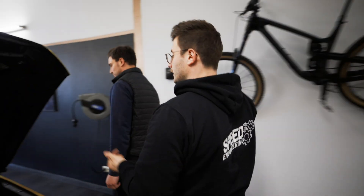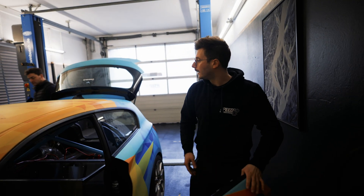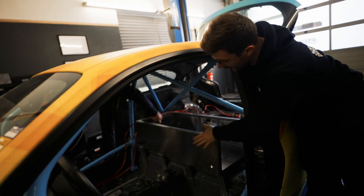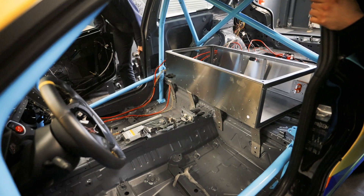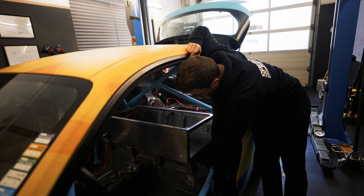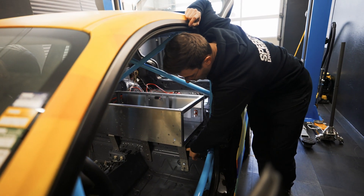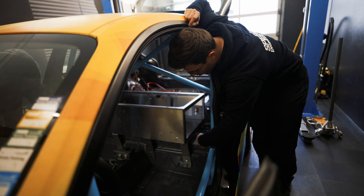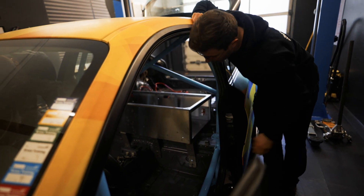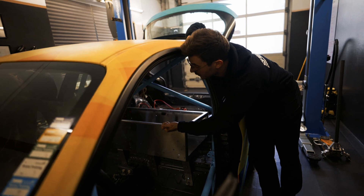Let's go to the back to talk about the batteries. Here is what the battery box looks like where the back seats were. We also have to adapt the roll cage slightly — we'll replace the H-tube to go underneath our connection points, and add a safety tube to prevent any battery box movement toward the driver and passenger in a crash.